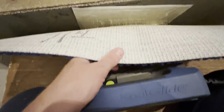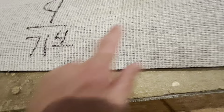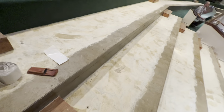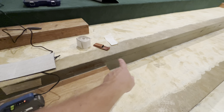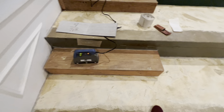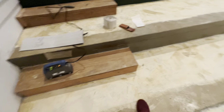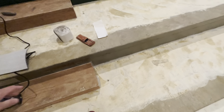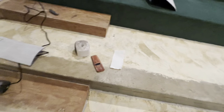That's twice. Look at that stuff - it's so big. No burning on the carpet - you can see the glue right there. Everything looks good. I was actually a little concerned about that. That's the plan then - I'm going to full spray the top of these, put utility tape right on the front of that, just one row right on the front. I might put a little flat trowel of glue on the back of that piece of carpet below the tape, just something so maybe it'll stick down there. The utility tape is going to keep it pointed straight down. I'll probably get a carpet kicker, push down and melt it right here to the front. That's the plan on that.